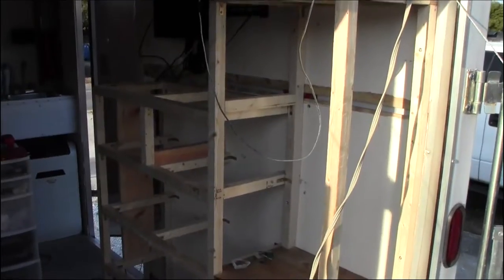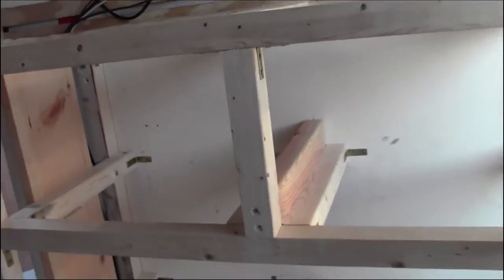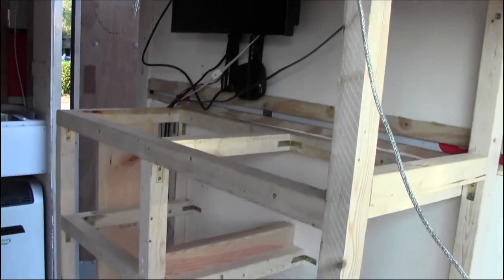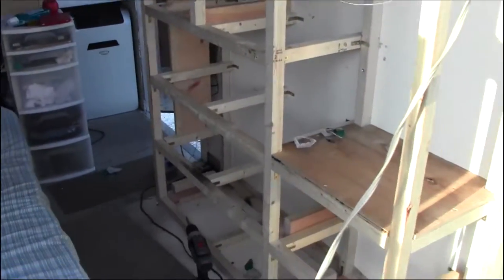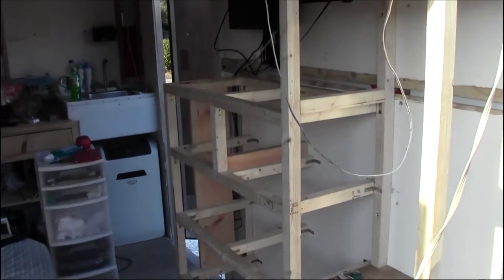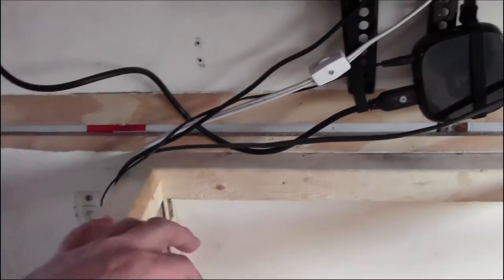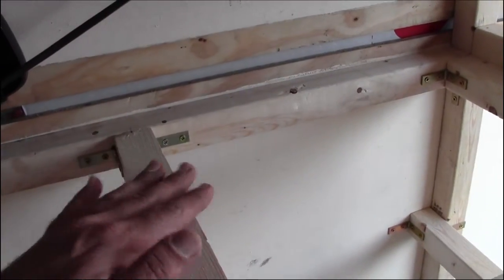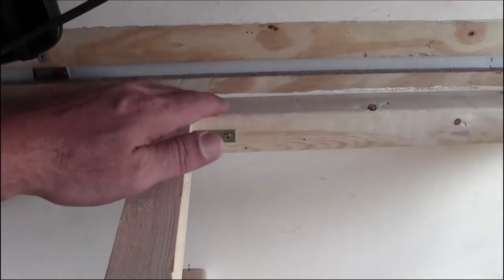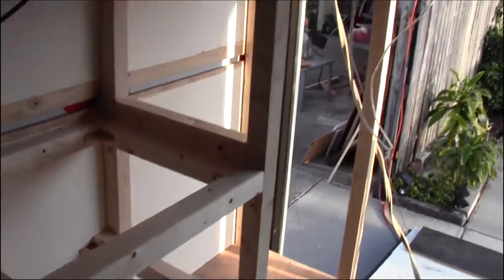As you can see, I have pretty much finished the entire skeleton of the whole thing. I went ahead and made double door drawers up in this area and made the divider in the middle. Pretty much all I need to do is figure out all the lengths of the plywood to put on the outside. One mistake — maybe a couple — is this piece of trim that goes across here. I didn't leave space for the piece of wood going on top, so I'm either going to put it in behind and make the piece, or put the piece on and cut out the molding. I think it worked out nicely.